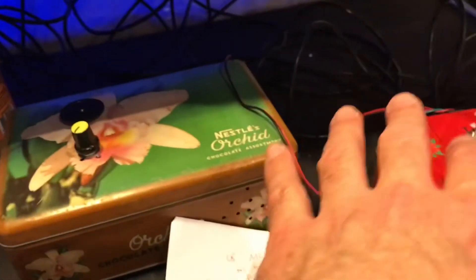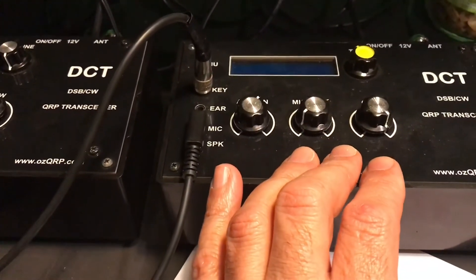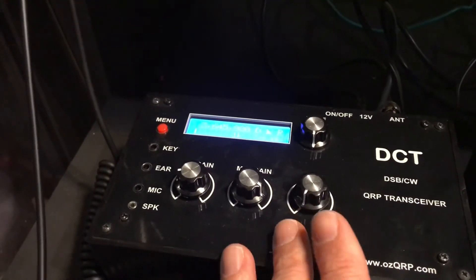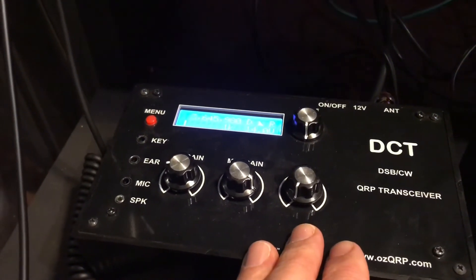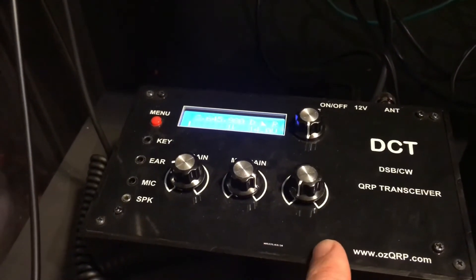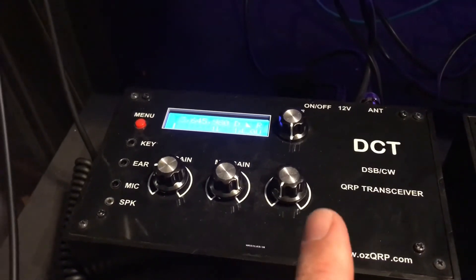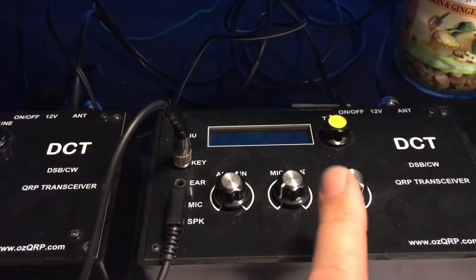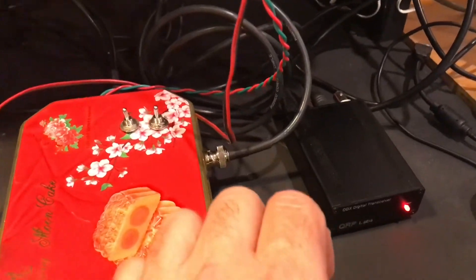The chocolate box receiver has a little switch on the side that switches between two ceramic resonators - whether I want to listen to the sideband portion of 80 metres or the lower end of 80 metres for CW. We've also got a Baofeng UV-10R, though VHF two metres doesn't really interest me that much. Then we built the AusQRP kit - I've done both double sideband and CW QSOs on that. It's a very functional radio, 150-odd bucks in kit form, very easy to put together. Most of the surface mount devices are preloaded on the board - you just have to wind toroids and put some through-hole components on.